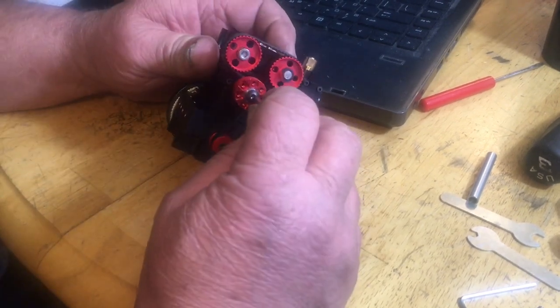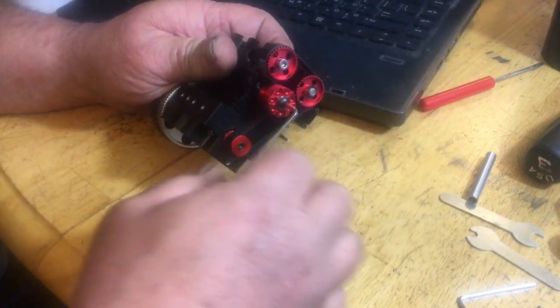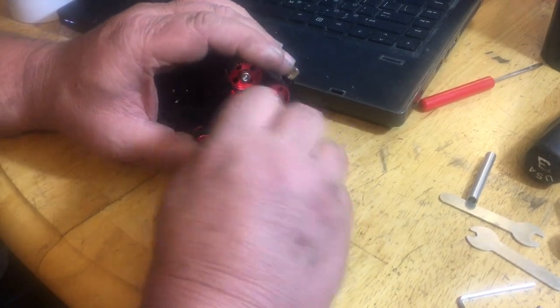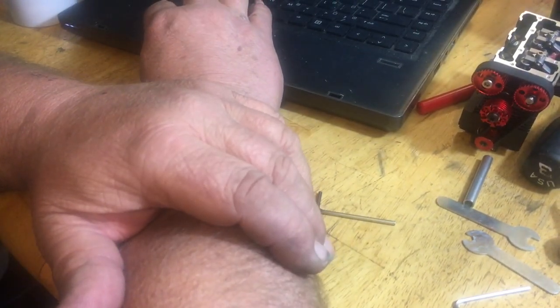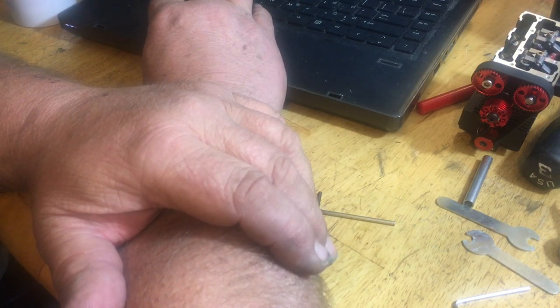And put our fan blades on last. I always wait till last to put them on. They're very simple to do. That way, when we have to readjust the belt after you start it, it's easier to do it that way.